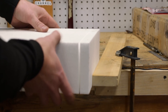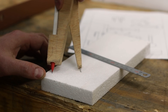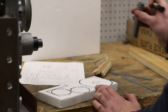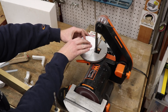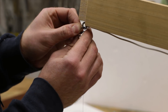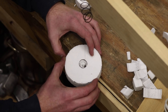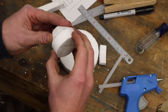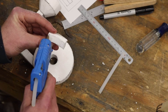I really am getting to be quite the fan of lost foam casting. It's so much superior to making wooden patterns, especially for a project like these Gingery machines. If you're making a lot of parts it makes sense to invest in a mold that you can reuse in green sand. However, if you're doing one-off castings, it seems to me superior because you make a pattern that you then cast and you don't have to deal with extracting that pattern from your green sand mold. That's the big advantage, and I really like the tolerances that I get when using lost foam.